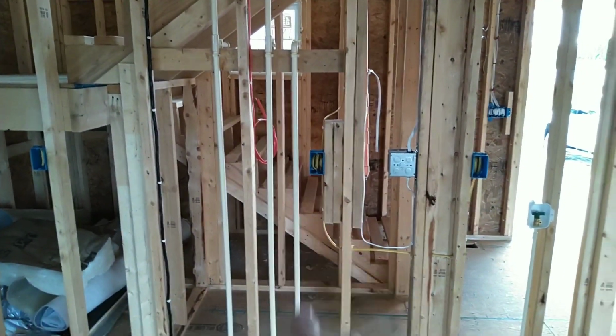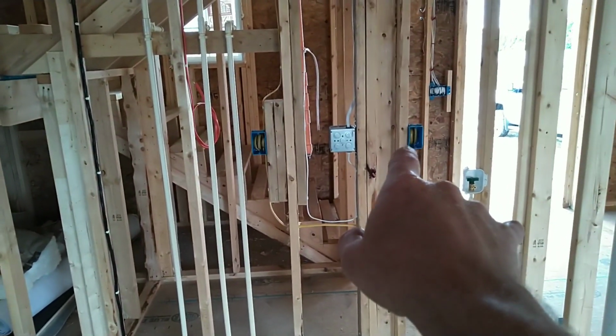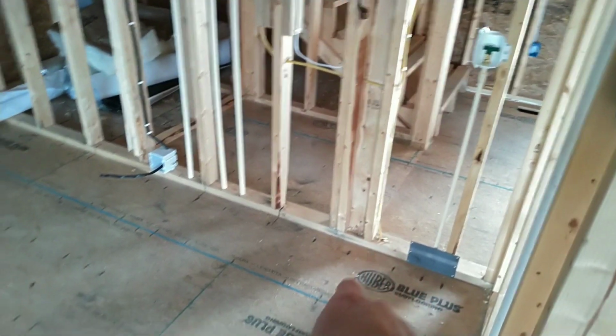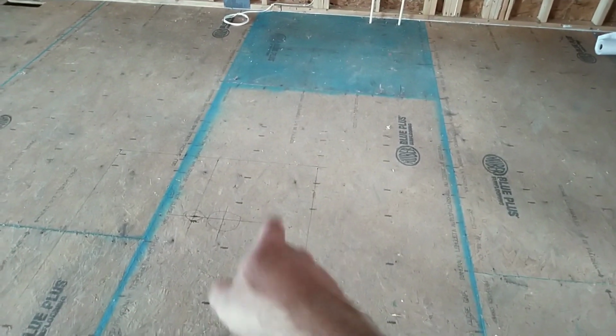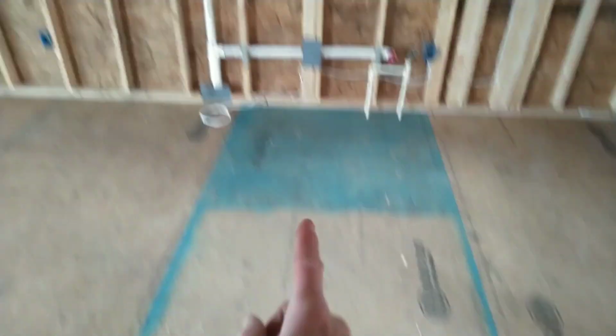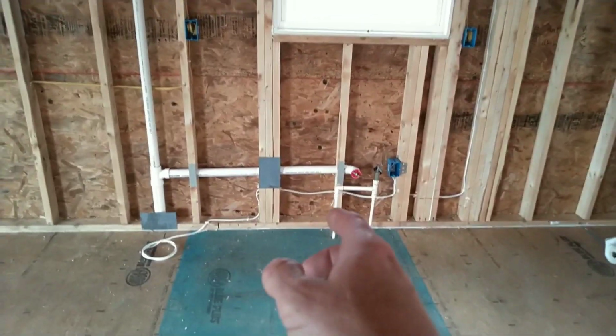I've got a home run that lands on this 15-inch counter right here, and then it jumps on behind it to the refrigerator. And then of course this wire that goes down is going to be my wire loop, travels under this floor, and it's coiled up over here, and that's for the island that gets an outlet on that end of the island. Of course, we're on the 2017 code. I only have to do one outlet per island. We're not on the 2020 yet.